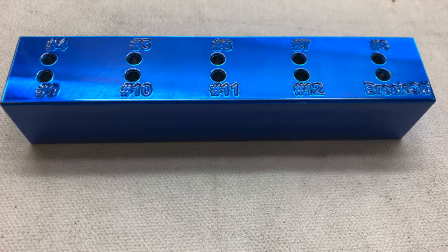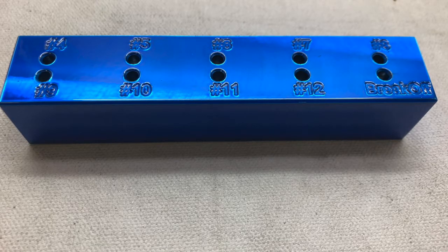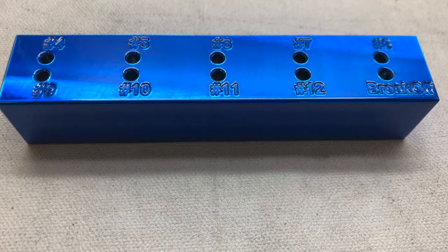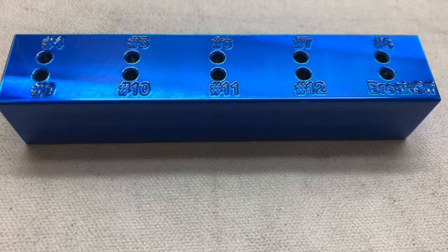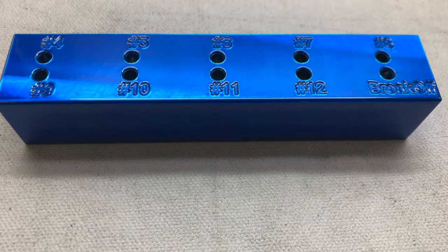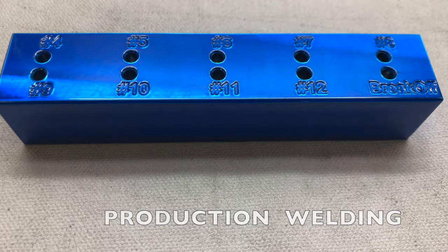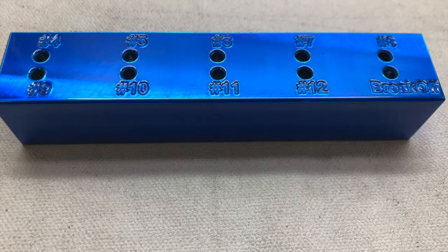That's whether or not I want to match the diameter to the stick-out — the cup size diameter versus stick-out. Sometimes I'll go up and down in sizes, but bottom line is I like knowing exactly what that stick-out was so that I can easily set that stick-out again, especially in a production setting. If you like the way you just laid down a bead, it's nice to know exactly where that stick-out was.